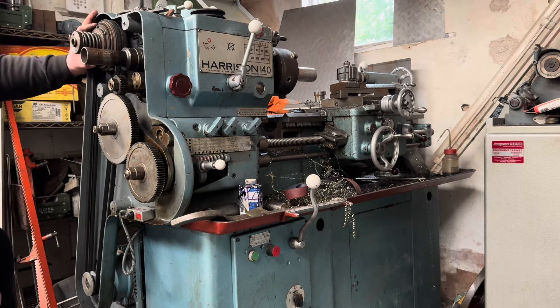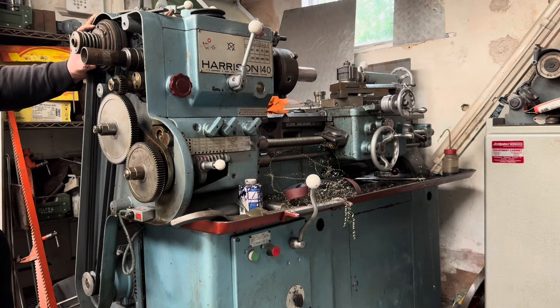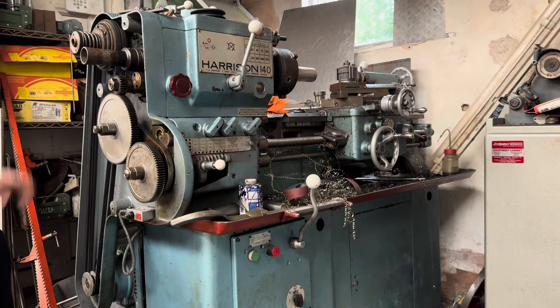I'm going to have a look at the clutch plate, because that's where a lot of our rattle is coming from — this plate moving in and out. I'll bring the camera in and show you. I've seen a few people put springs behind this plate and also make new pins to suit the oval holes. My holes aren't that oval but they are worn, and that'll be where the rattle is coming from. I think we'll put some springs in.